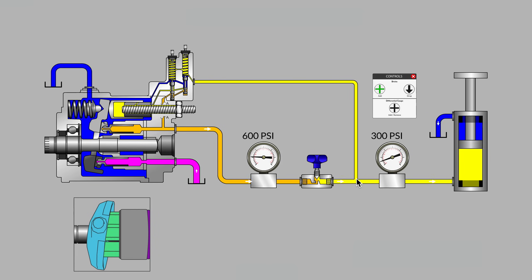The cylinder is working at 300 psi — that's the pressure it takes to lift the cylinder and rod. That 300 psi is being fed back to the controller and giving that spring a boost. The spring is actually set to 300 psi. I figured that out because our pump outlet pressure is set at 600. So it's taking 300 from the load and adding it to the 300 spring setting, and those two forces add together to give us our regulated pump outlet pressure of 600 psi.